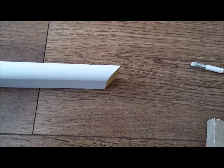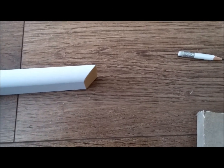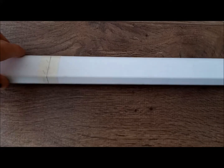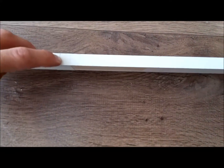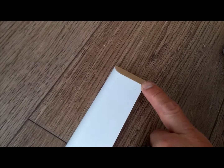I went out and bought a brand new saw to do this, because the last one I did with a worn blade, and as you may have noticed earlier in the video, the edges are not quite as sharp as they could be. Hopefully the new blade will mean that everything will be crisp and sharp. Mark your final cut, remember to mark the wastage so you know which side to cut. Also remember to take two millimetres off the total length to allow for a little bit of sliding backwards and forwards, to ensure that the corners will meet perfectly.